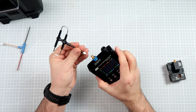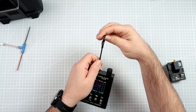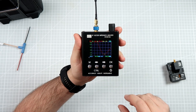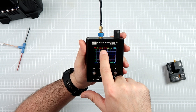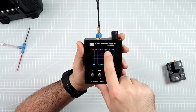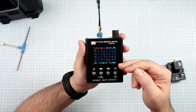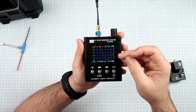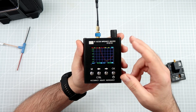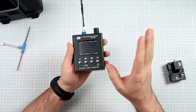First, in our experiment, let's check how the antenna tunes when it's just connected to the VNA. It's tuned at 898 MHz with a VSWR of around 1.4 — that means it's a very well tuned antenna. We say an antenna is tuned when the VSWR standing wave ratio is below 2, and 1.4 is a relatively good result.